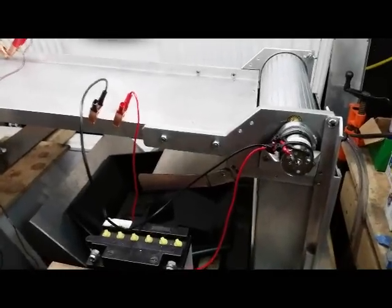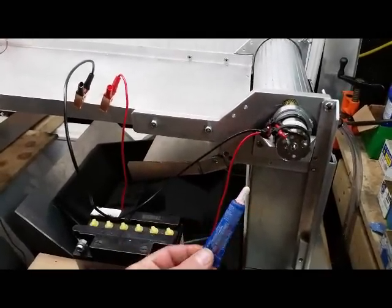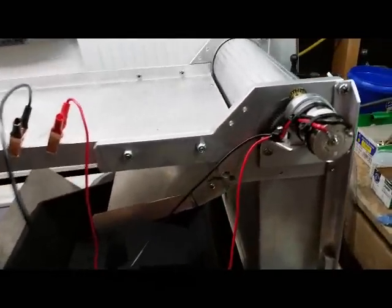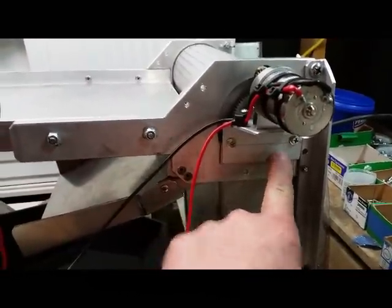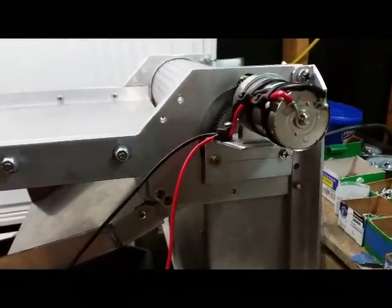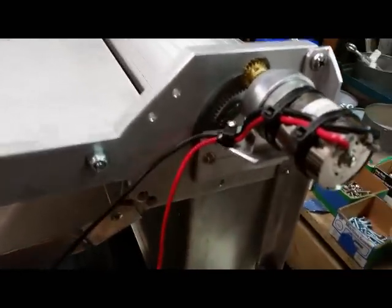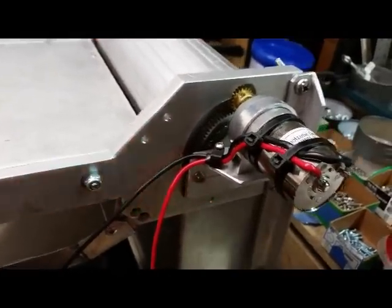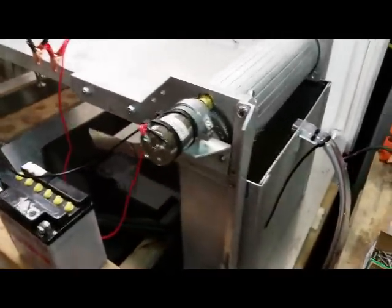Several quick things for setting up your magnetic device. First off, you'll use this thread locker that I'll send with the machine. There's probably just enough to attach this motor. Put the thread locker on these two screws and screw them in very gently. Make sure you take care not to cross-thread on the way in. The motor should fit right on there, perfectly lined up in the teeth where the screws will line up. It's just a simple process to thread-lock those nuts in.